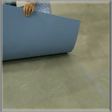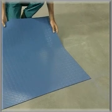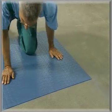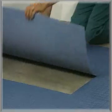Spreading the individual tiles beforehand, firstly, means the material adjusts itself to the subfloor's temperature, which is advantageous for subsequent installation, and secondly, ensures that the cross joints match and won't have to be recut during installation with the tiles already in the adhesive bed.